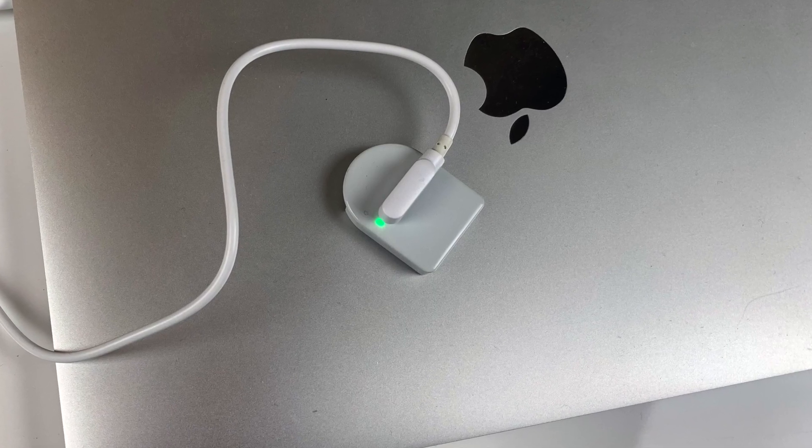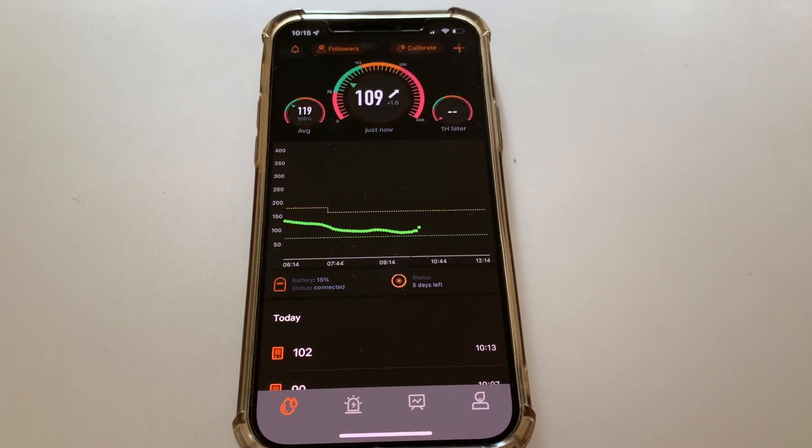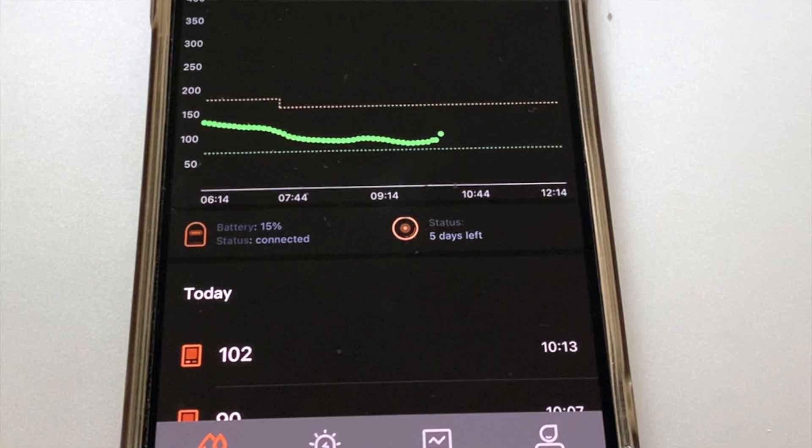The next important difference is battery life. The battery in MM1 has double the capacity of the battery in MM3, which is why MM1 is a lot heavier but will also last longer. The manufacturer guarantees a 14-day battery life for both versions, but from my experience the MM1 transmitter lasted over a month. The new MM3 managed to get through the two-week guaranteed period but died shortly after — on day 16 or 17 — while MM1 still had about 70% battery remaining.